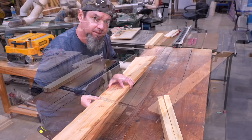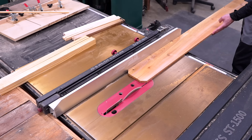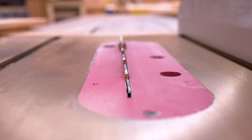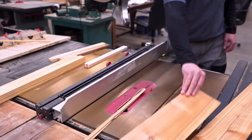To start, I'm going to clean up the outside edges. I want this planter to be nice, clean, and sharp looking. I'll just be taking off about a sixteenth of an inch. Now that I have one edge cleaned up, I'll cut this to size. If you notice, this planter sits at an angle — that is a 10-degree angle, and there will be several parts cut at 10 degrees. That's the only angle we're going to be cutting at. For the sideboards I'll set my saw at 10 degrees, then set my fence at five and three-eighths of an inch away from my inside tooth. Since my sidewall boards are now ripped to size, let's head over to the miter saw and break these down.